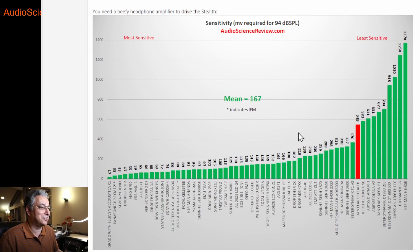At 549 millivolts, you're in the next bracket that requires more power. Just about every headphone amplifier I recommend will easily drive it, so don't think you need something fancy or special. I use my RME ADI-2 DAC as the test platform in my everyday listening, and while I had to turn it up to get the volumes I wanted, it had no trouble driving it. You just need a well-executed headphone amplifier. Driving it directly from a phone will probably work, but don't expect it to get very loud.